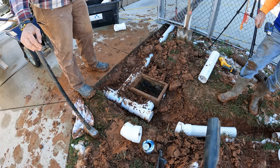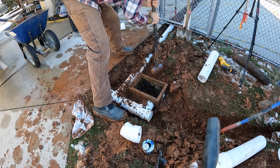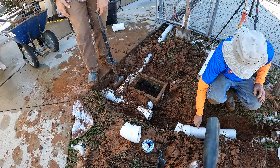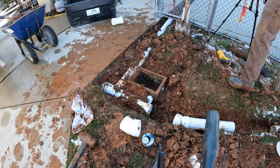The other thing is this is four-inch pipe, which is way overkill for what we're trying to accomplish here. So even though you're not allowed to lay sanitary tees on their side in plumbing applications, we're fine doing it with four-inch pipe at a full bubble of fall in our drainage systems.